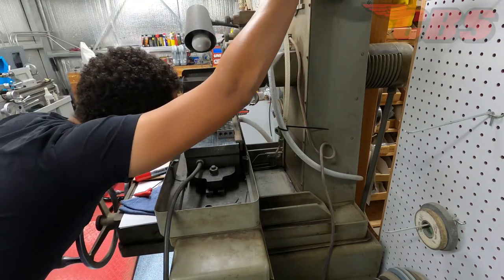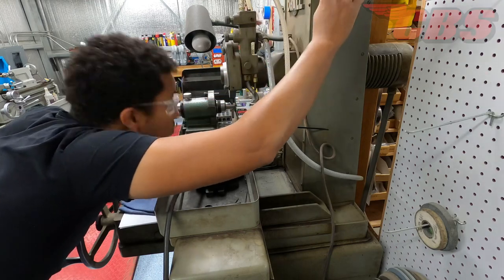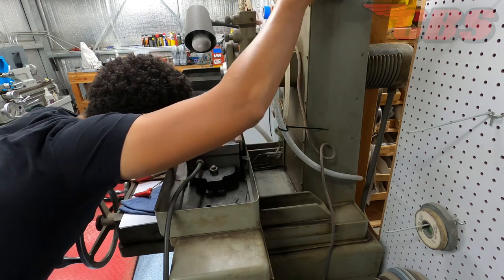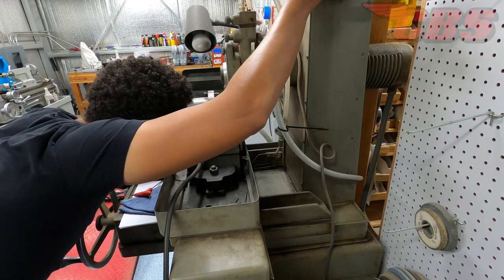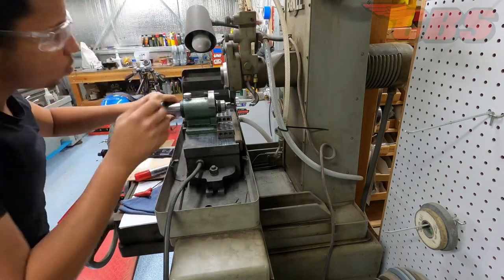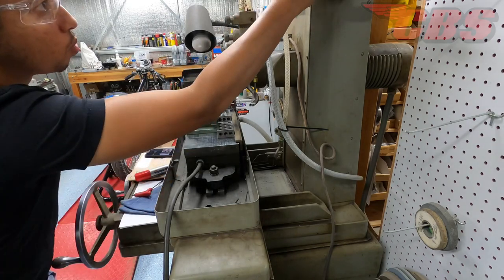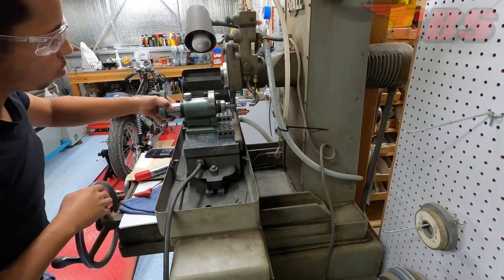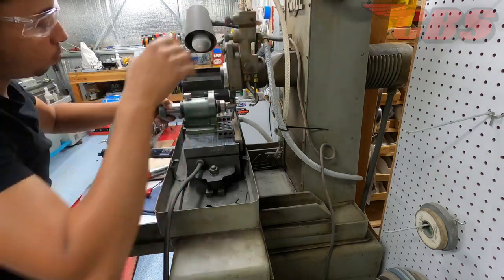The video is not going to get into detail on how I set it up, but I use the height gauge to make sure that the flats of the follower are parallel to the table. If they're parallel to the table, that means the pad is going to be perpendicular to it, which it needs to be. Most of you working on Triumphs or BSAs — if you put a cam follower in the tappet block housing, you'll see the cam follower can rotate with some play. That does help the Stellite pad properly center itself on the cam lobe, assuming your tappet block is squared away.